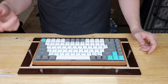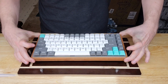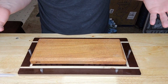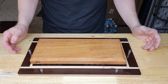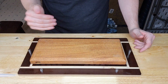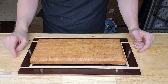And so you have to think about how you're going to hold on to the part, how you're going to zero your work offsets, how, if you're going to flip it, you're going to keep it in alignment, how, if you do take it off and you cut something off, is that going to cause unrepairable damage that you're not going to be able to finish the project? So you have to think through the process start to finish and structure your order of operations in a way so that what you do in step 1 doesn't mess you up in step 2 or step 26.